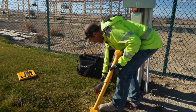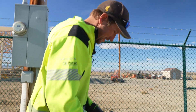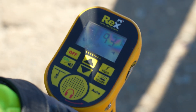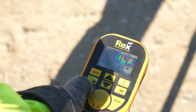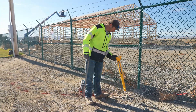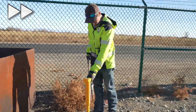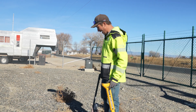I almost forgot the most important thing: when you're trying to locate a utility, it's a good idea to mark it, because you're not just trying to find it for yourself — you're trying to find it for other people. It's telling me that it's right here. I got some numbers and arrows telling me to go that way, and it tells me it's right there again. What I like to do is pull a depth to see if it's really giving me a good reading — it's telling me it's one foot four inches. I'll turn the sound back on so we can all hear what it sounds like. When you hear that noise, it means you're on top of that utility. One foot eight inches — it's still reading pretty accurate, and that's just going off that clamp. There's no ground cable; we just have a clamp placed around that conduit sending a signal down that power line.